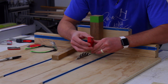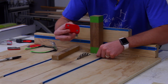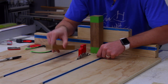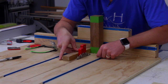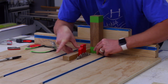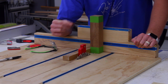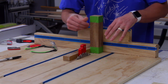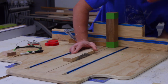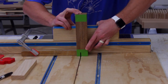Using my mag shims — the red pieces — they are an eighth-inch thick and I've got five of them. They're magnetized, so they stick right to my blade, right up against the teeth. I'll take a piece as a straight-edge guide, put it right up against the mag shim backed up to my fence, and then push my block right up against it, which will give me that five-eighths of an inch overhang on either side. Then I just make a pass, clip edge for edge, and make another pass. I'll set up my stop block to keep that in place and set up the blade height to just barely poke over the board.